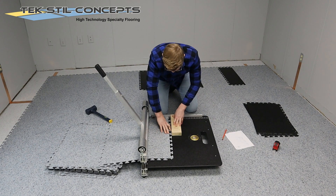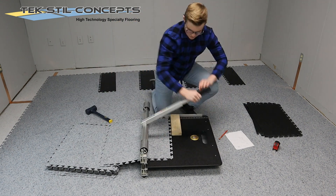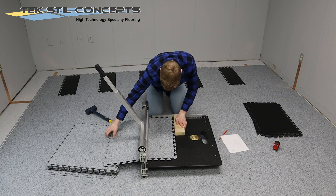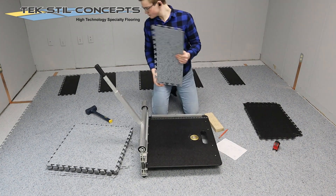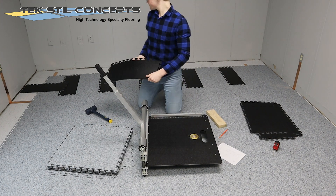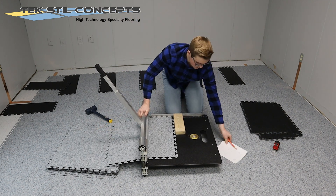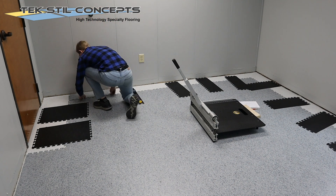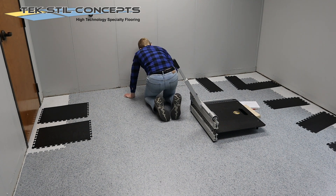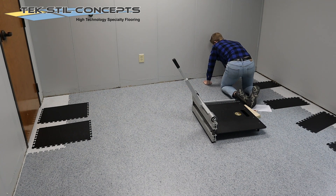Because the tiles visually blend together so well, tiles should be placed face down with the backing side up until ready to place and tap them into position. He is using his tapping block as a guide to help align the tiles to the ruler on the tile cutter. He took measurements for the edge pieces, except for the corners — he will measure and cut the corner pieces last. He wrote down his measurements and cut them all at the same time, then placed each cut piece where it will be positioned. Now he just works his way around the room, tapping them into position.